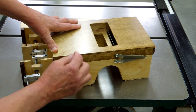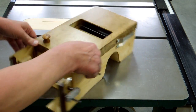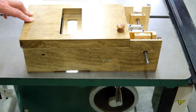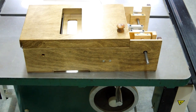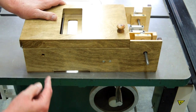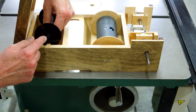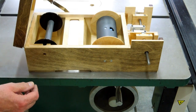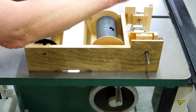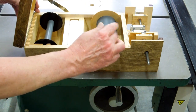The crankshaft drives a little wheel that turns a disc with a Hoover vacuum cleaner drive belt mounted onto it, and that in turn drives a disc that turns the take-up spool. I have not mounted the plexiglass yet, mainly because I don't want to scratch, dirty, or break it. The rewind mechanism mounts here — an Allen key goes in and out of this hole and engages with a hex socket built into the plastic spools. When you push it in you can rewind the music, and the clutch over here disengages so this will spin freely.